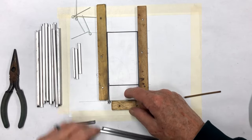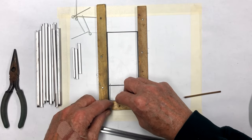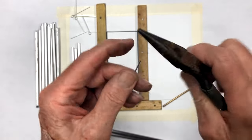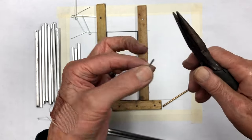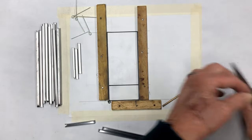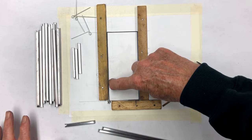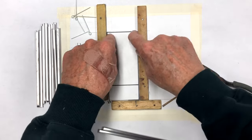This down leg here is extending beyond our header glass, so I'm going to take my long-nose pliers — these have a side cutter on them, from here to here is a quarter of an inch — push it through until it just touches here and cut it. Now when it goes in here, you can see it's short. If you don't do that, when you start to put your glass in and this is hanging down, it'll start crooked, and if you start to build crooked the whole thing gets worse as it goes down.